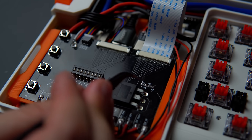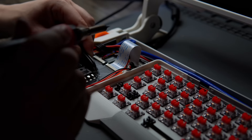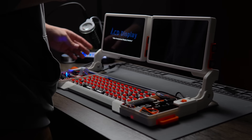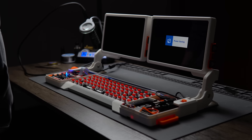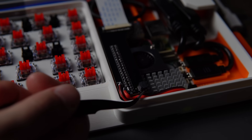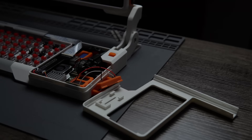It should be relatively easy to just desolder and switch those resistors and then we should be back on track. After the fix, one screen, two screens came on. There was also a short on a small quick connector, which was causing a boot sequence failure. Once I replaced it, everything powered on. After a couple of setbacks, everything was finally working and I could finish putting this thing together.